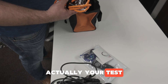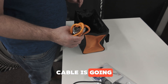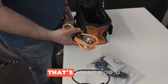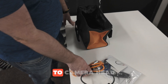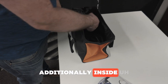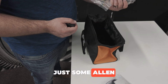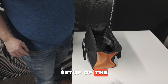This is your meter counter, and this is your test cable. The test cable is really important because it connects the camera head directly to the monitor box, bypassing the reel — so if you ever need to troubleshoot, that's what you'd use. The video link cable just goes monitor to camera head for testing. Inside there are also some extra feet for the reel setup and allen keys you might need for doing the setup of the actual reel.